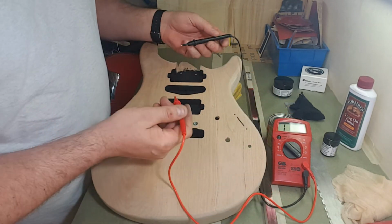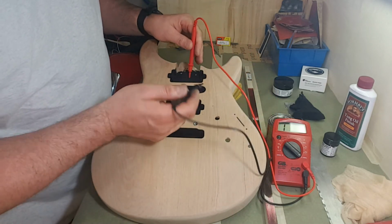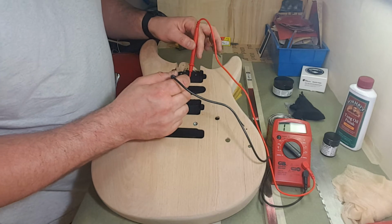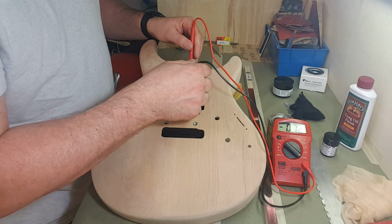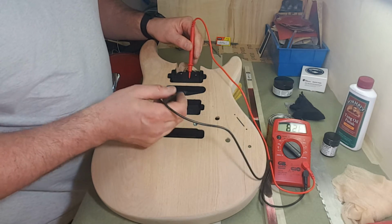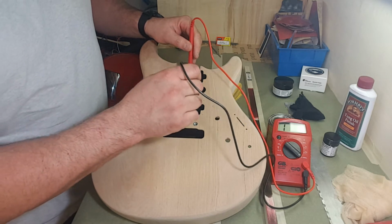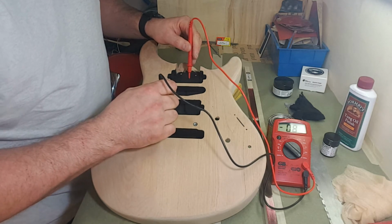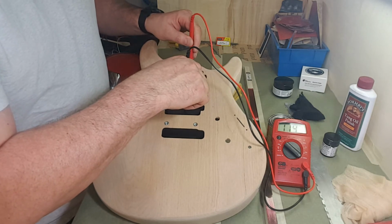It builds excellent. It's thick. We'll go all the way from the humbucker. I have kind of a unique setup here. There's a lot to connect. You couldn't really do this with copper. So I'm going to just go in the corner, clear over here, corner, clear over here. We're going to get inside of our channel that the wire will run through. We'll go right to the bottom. Move all the way up in the very bottom of this deep humbucker cavity. And same thing on the other side. Back wall. Clear as far away as you can go from the 2 points.